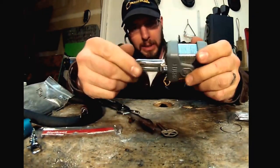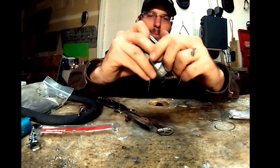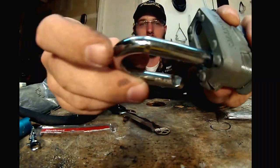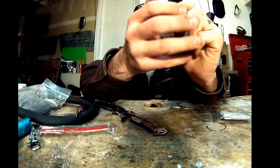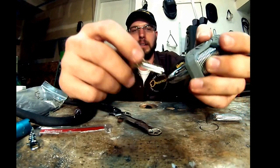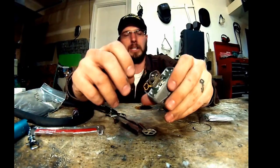I was able to shave a little bit of this and actually bend it back right to where it would function properly and actually re-lock, and then it would release the key again and lock up. We are going to send this out. My opinion remains the same on the SmartKey — it does not seem like a quality product. If the shackle's going to break when I'm not even trying to cut it, and you can see that it is cracked all the way around on this side too — take that as you will. They make it look fancy, but if you strip this off, you've got a very unsecure cylinder in my opinion, and not the best shackle material either. On a laminated body, lots of moving parts and stuff in here too, so dirt and things like that are probably going to be not a very good thing for this lock as well. For more information, check out the website below.